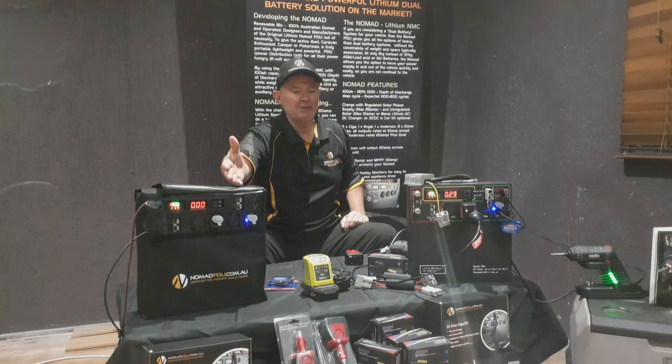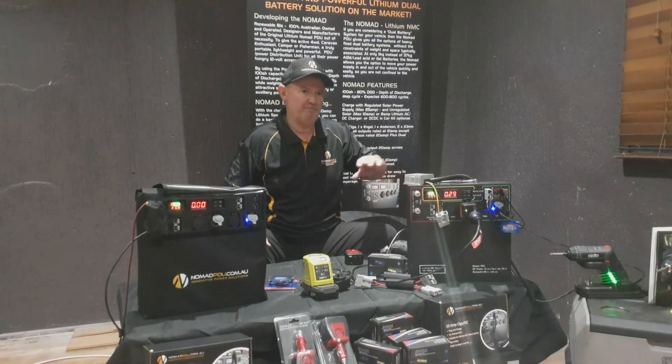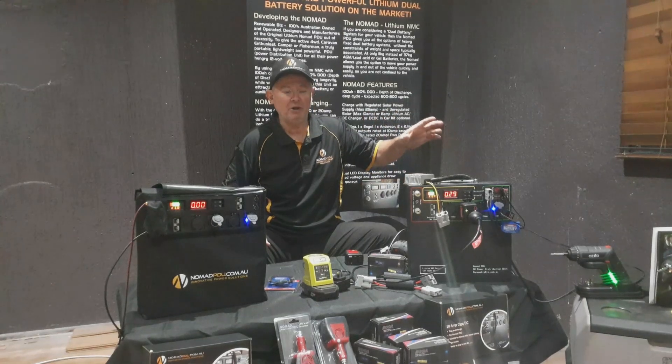It just means you think you can get 20 amps out of it and you should be able to get 25 or 30 — absolutely not. It's designed to protect yourself. Don't try and pull any more than 20 amps. You're going to be out in the middle of nowhere, and you risk shutting it down.